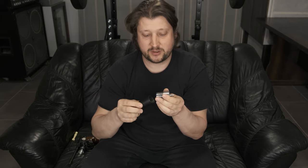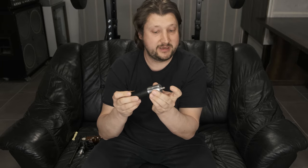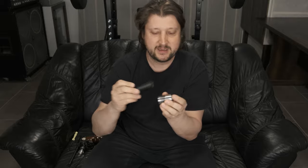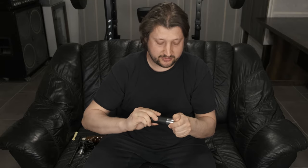And even with all those precautions, what I did is, when I put this one-way fill nipple on it, I first put it without the one-way valve. I put everything together, I put everything in a blanket, put it behind the wall, and then I filled it to 330 bars, which is the maximum I can get on my compressor. So I wanted to do this test first before I ever filled it to a high pressure. And I left it that way for, I don't know, 30 minutes or something like that. After that, I drained it, and after that, in my perspective, it's considered safe. Of course, you never know with high pressure, so you're cautious. You always have to be cautious, let's put it this way.